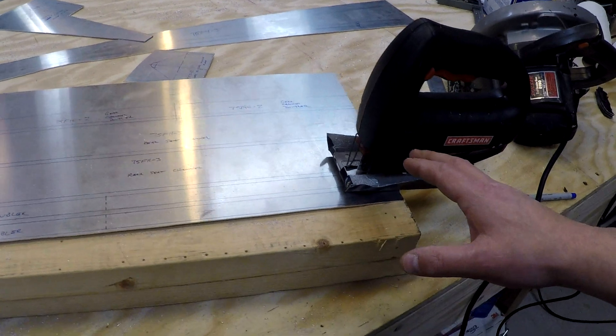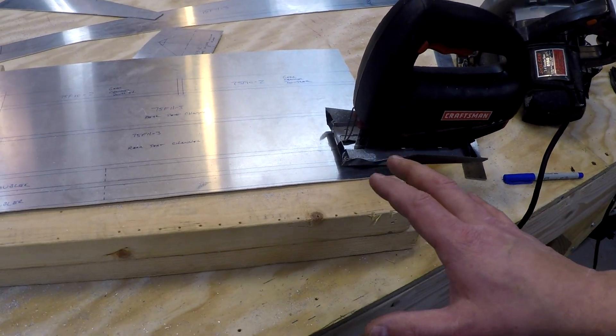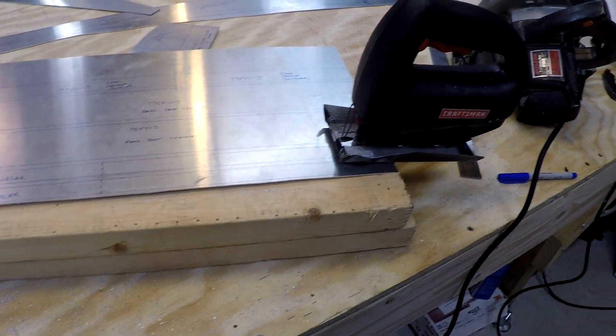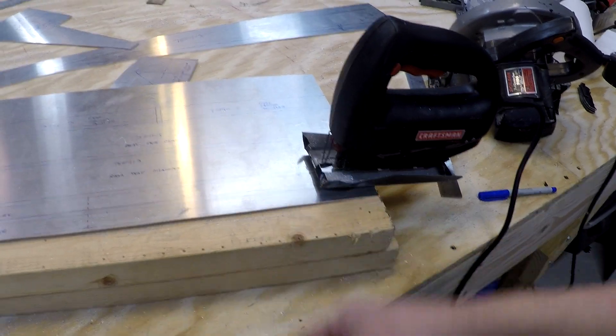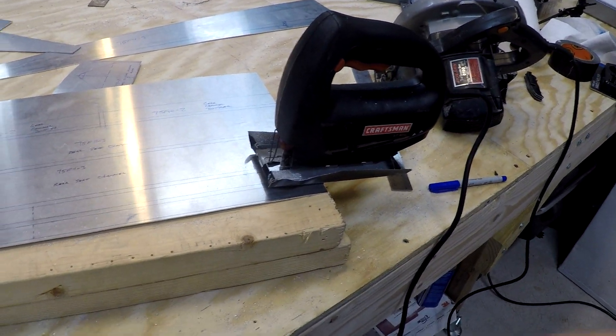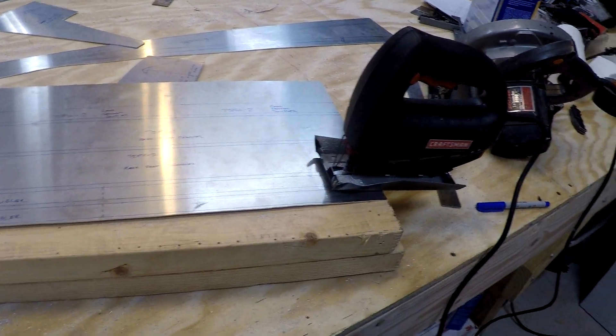This method is fairly slow and produces a decent cut, but it is slow. I'm going to set up the camera and give you a quick idea of how slow you want to go. If you push the saw through the material too much you'll load up the blade. It's best to just let the blade itself do most of the cutting and guide it where you need to go.